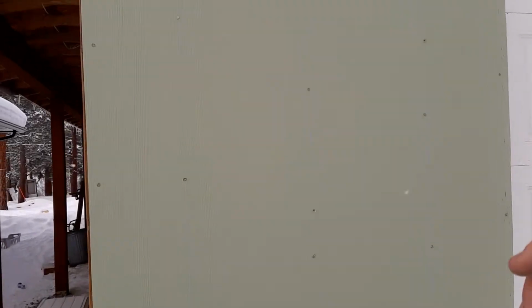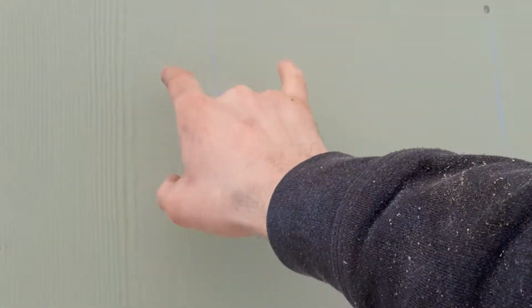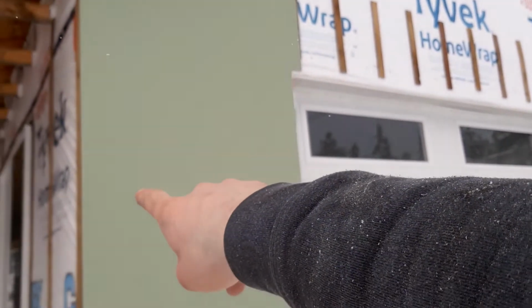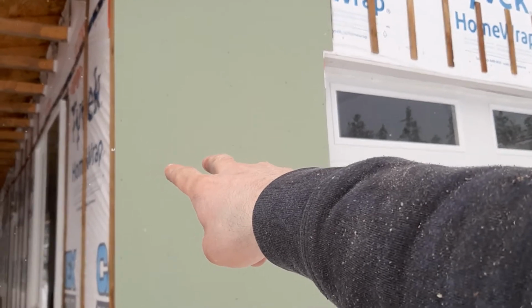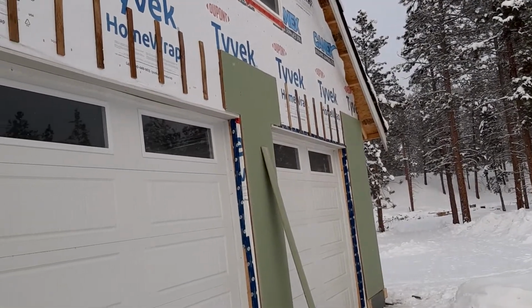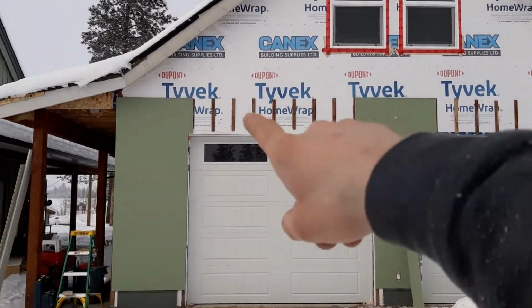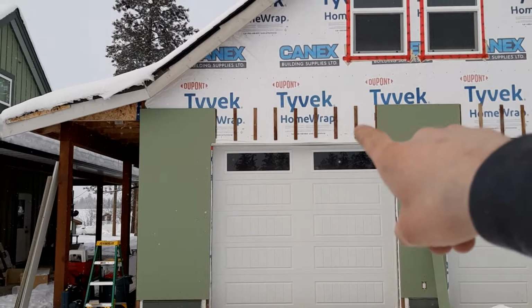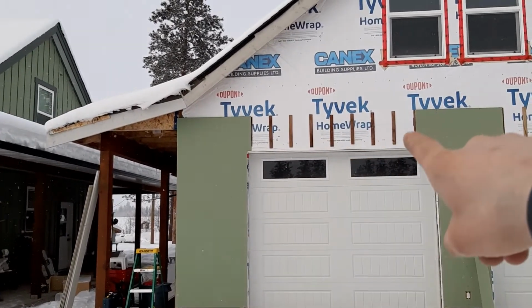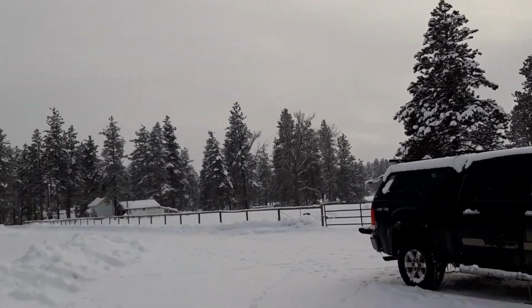And then here I'm going to have some trim, and then 1 close batten. It was either having an odd spaced one on the ends, or an odd spaced one in the middle. And I think it's going to look better this way. So I'm going to leave the middle pieces because I can probably use offcuts to finish up above the doors there.